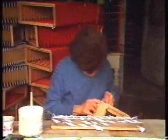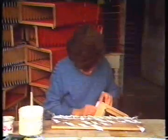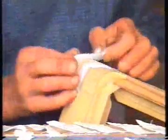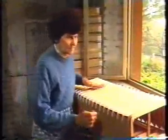The corners, which are subject to considerable mechanical pressure and must be perfectly closed, undergo other minute working operations. The bellows are an essential and very delicate part of the accordion, which must also be very strong and indestructible. Just consider that the bellows open and close thousands of times during its life and must remain elastic and perfectly airtight.